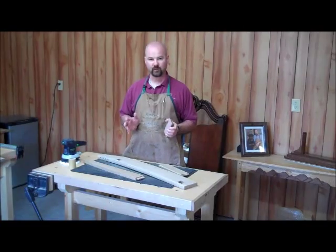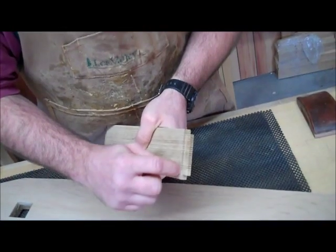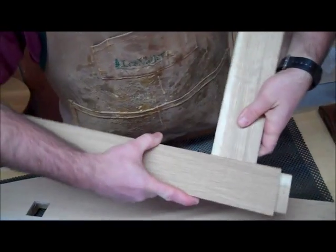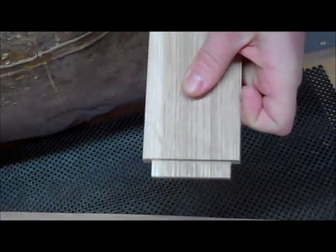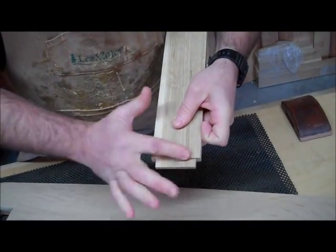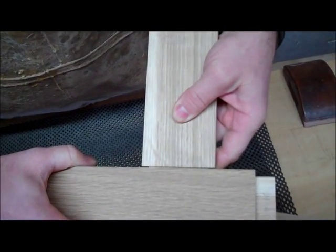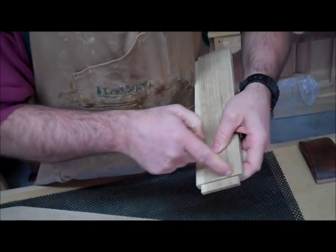There are areas to avoid. You'll want to avoid areas where there's joinery — for example, the shoulder of this tenon. What you're trying to do is get a nice crisp joint line between the tenon piece and the mortise piece. If you sand or ease this edge, you'll end up with a shadow — it'll look like a gap when the joint goes together. So don't sand that particular face or ease that edge.